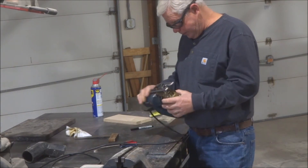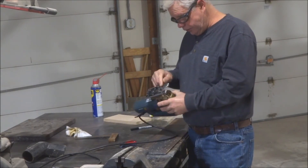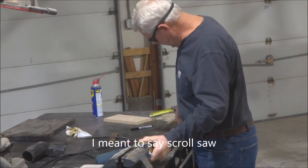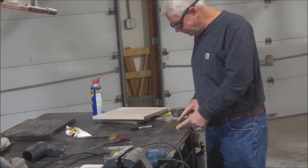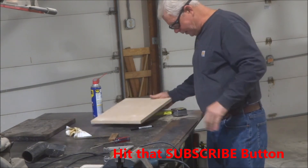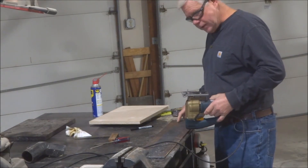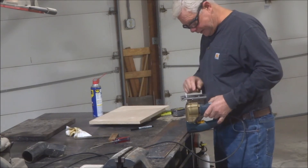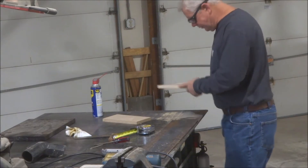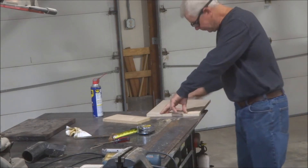What I'm going to do is make a little contraption to hold this thing upside down so I can use it as a scroll saw to make a couple of projects I'm working on. I'm going to take a piece of flat bar, route out a little section so it fits in flush, bolt it up underneath and attach it, drill some holes through the flat bar. Then instead of making a big box for it, I'm just going to bolt the thing right to my table. That will give us a full saw right here.